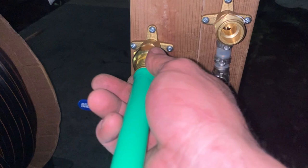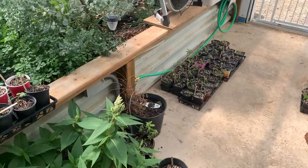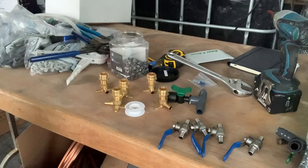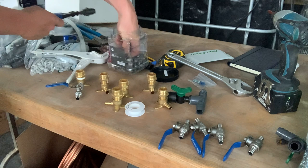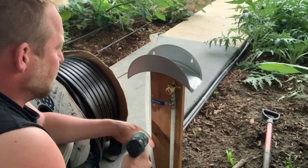This way I'm not tripping over garden hoses. To make that, you just need some PEX fittings — half-inch PEX. They didn't have an all-in-one system for a valve, so I made my own standard. I like the quarter-turn valves because the twist ones might get seized up. It's very secure so nobody's ever going to rip it off.